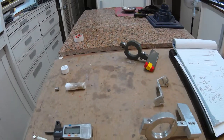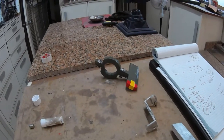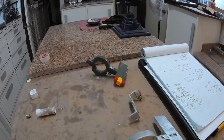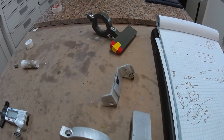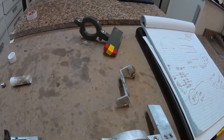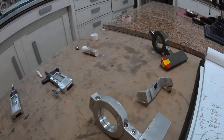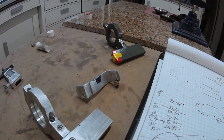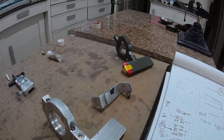What I did at first was make a prototype model out of wood. It worked well, I just didn't want to leave the wood there permanently. The second bracket in the back is simply two-inch aluminum angle, with a hole drilled in the front to catch the screw from the protractor I don't use, and a little tab on the back to hold the rare earth magnet in the right position.